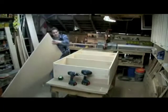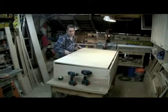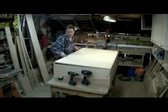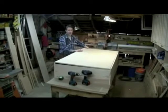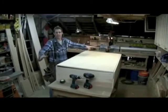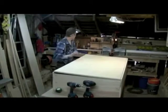Now this is the fun part. Remember, if you used a table saw and set your fence to 34 and a half, and here's the moment of truth - if this and this are exactly the same, what's going to happen? It's going to be tight. Don't misunderstand me because you're coming at a little bit of an angle, but when this drops in, it's going to square up your bookcase. So as of right now, if it's not perfectly square, when I force this in - and I might have to force it a little bit because it is tight - it's going to square up the entire bookcase.